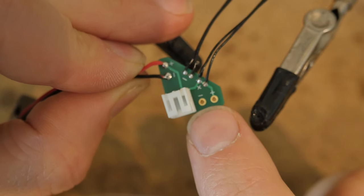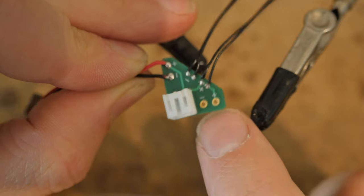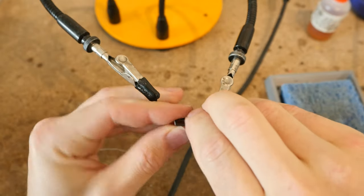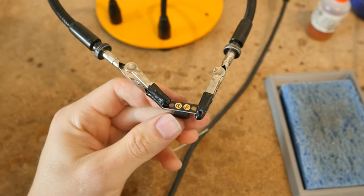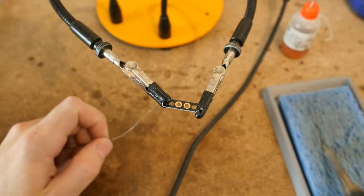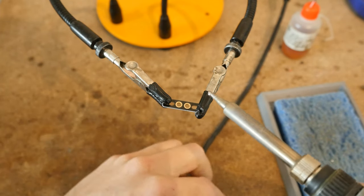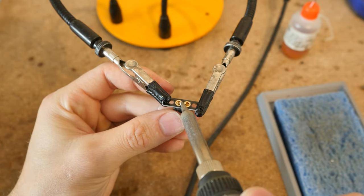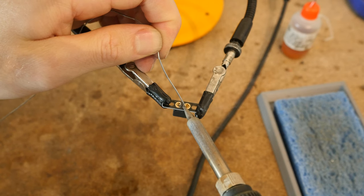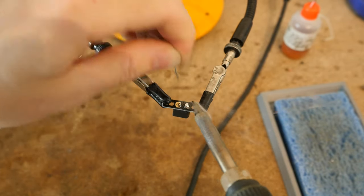The reason why I have two extra pads here is in case you have any peripherals like LEDs or a video transmission module that takes 12 volts — you have two extra pads to solder to. To assemble the XT-30 power connector, I use alligator clips, put some flux on there, and preheat the iron to 350 degrees Celsius. I'm just going to get a little blob to tack it in place. Let that solder flow. Now it's in place and I can solder like normal.